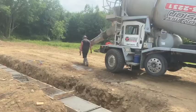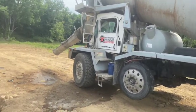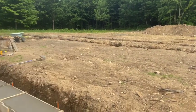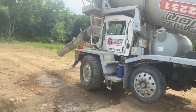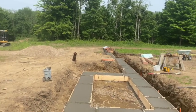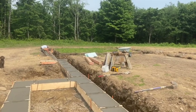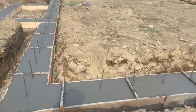We had to get a balance truck of four and a half yards - that's kind of how we planned it, to dump 20 and then get a balance. We've got a little gap to fill from here over to about there, so four and a half yards right here. This is Dwight bringing this load - just getting the chutes on, mixing it up and we'll fill it in. We've been wet-setting rebar down through there. Rowan's just about done.